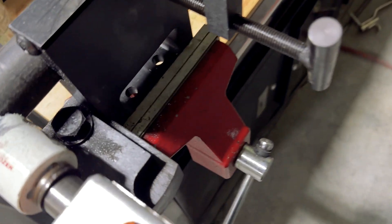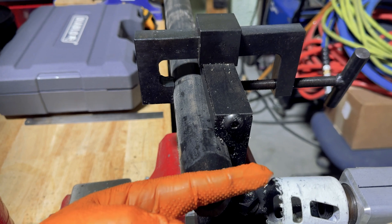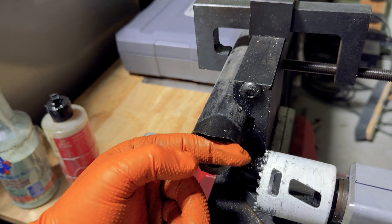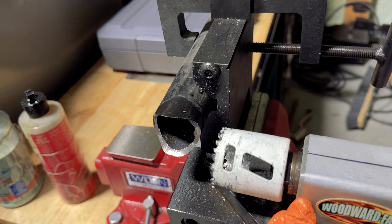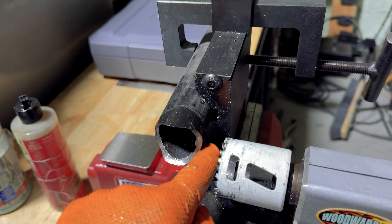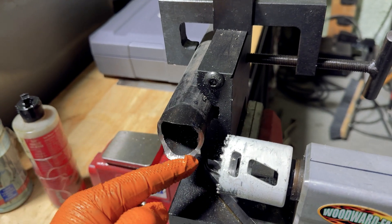This is going to be a straight 90-degree cut because it's going in on that bottom rail. The shape you end up with has a radius where the pipe fits on at the bottom. You don't have to use a fancy machine — you can cut this out with a grinder, carefully putting slots in and then cleaning it up. It takes a little longer but it's cheaper. If you go that route, make yourself a cardboard or 3D printed template with that shape so you can draw it around and match both pieces.